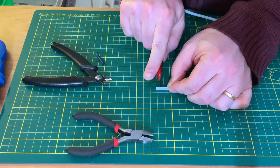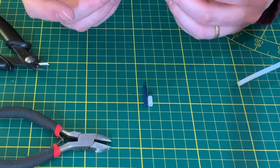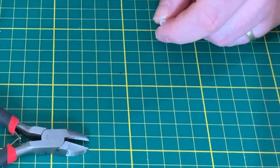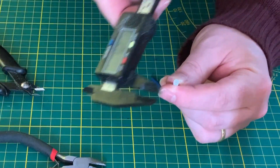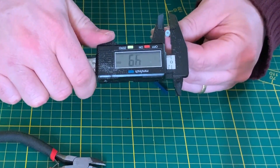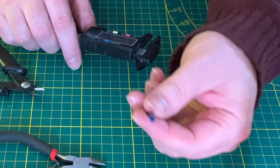Now I can show you why I'm going to exchange the tube. Like you can see, the tubes already look different — not mentioning the color because color can be deceitful — but the Capricorn tube is thinner. We are going to take the caliper: the standard tube measures 4.1 to 4.3mm, while the Capricorn measures 3.8mm. So the tube is indeed thinner.